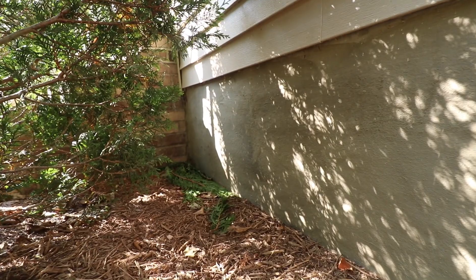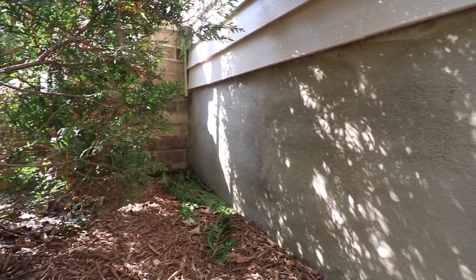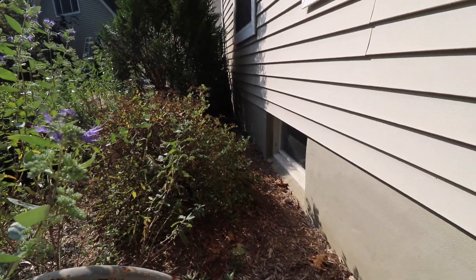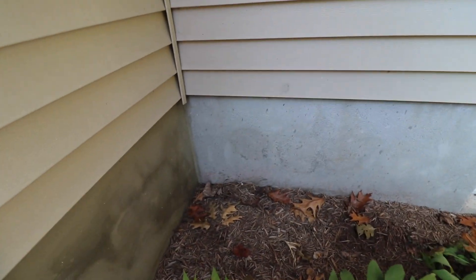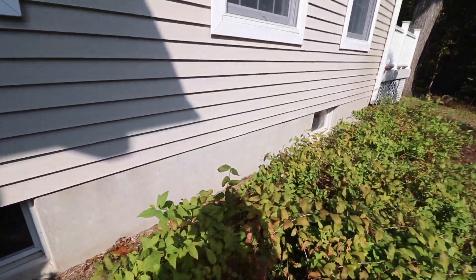Continuing on to the other side of the front porch — this is the part I got on camera. This part of the foundation also gets a lot of sunlight directly on it. I see what might look like a little streak — that's not a crack, it looks like when I painted with Portland, a little bit of water ran off right there. Moving into some shade, it looks a little better. I will say behind the tree it's a little sloppy, but it's fine — nobody's really ever going to see that. The spot where I had full control over the trowel and could really smooth it out nicely, this section looks really nice. That corner was tricky. You can see where I stopped and this is the original stuff. To match that, all you have to do is wet it and paint it with some souped-up Portland cement mixed with water into a paint, and that'll pretty much match in color.